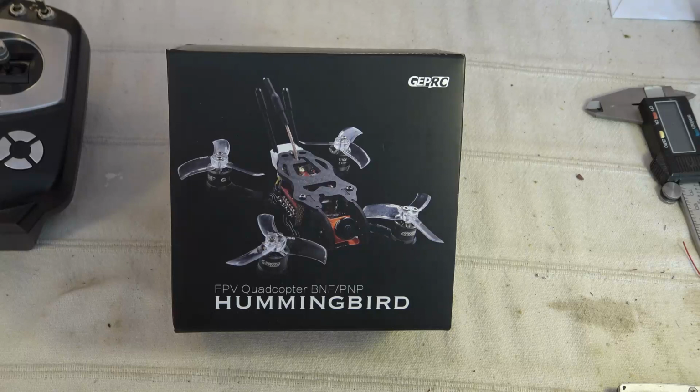More, the 48-channel video transmitter has different output power possibilities: 25, 100 and 200 milliwatt. More importantly, it is IRC Immersion RC Tramp protocol compatible, so you can change everything from the OSD side. Let's discover this new super brushless racer.